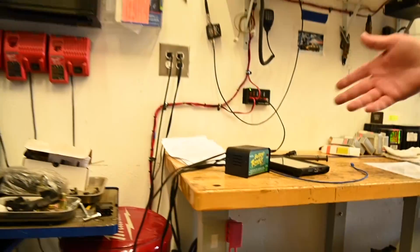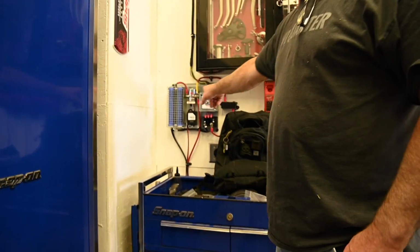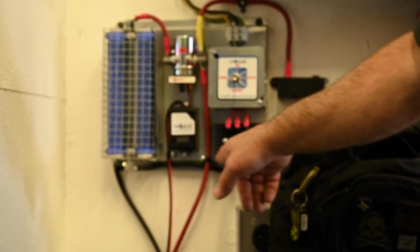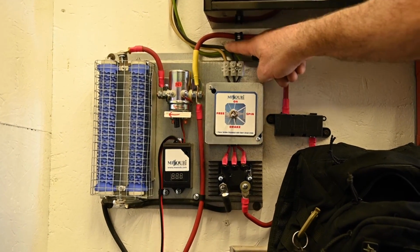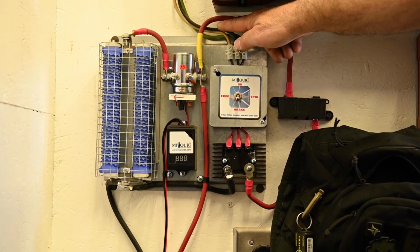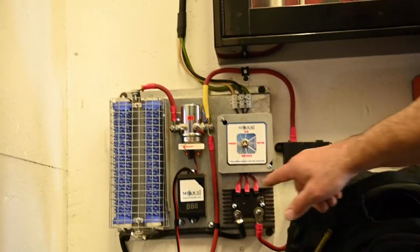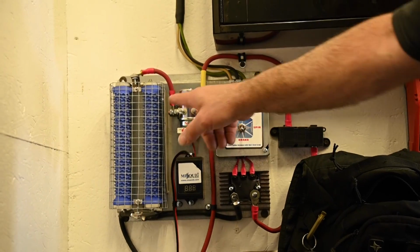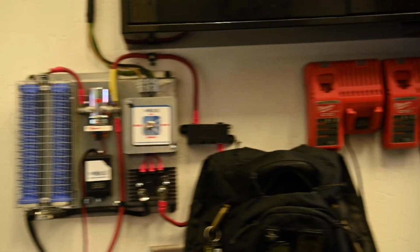And then it gets charged. Either I'll just charge it, or I've got a wind turbine on the roof that will, so it brings in, it's actually kind of cool. It brings in AC on these 3 phases, and then it goes through a rectifier bridge, and then it has a dump load, and it's kind of a keep your battery going whenever nothing's needed.